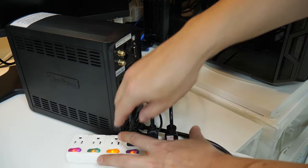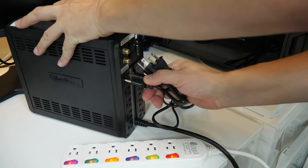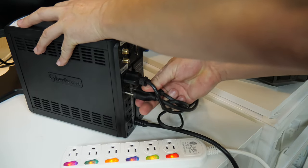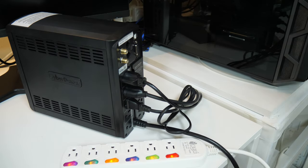So how does a UPS work? Installed between a properly wired grounded socket and your devices, the UPS battery charges and remains topped off, and during a brownout or blackout, the battery kicks in, delivering power to all battery side connected devices until the battery is exhausted. UPSs usually offer half their sockets as battery and surge protected, and the other half just being surge protected. USB connectivity can tell your computer the remaining battery time and trigger a shutdown through software.